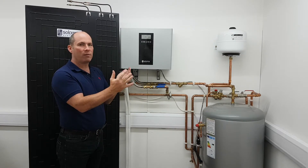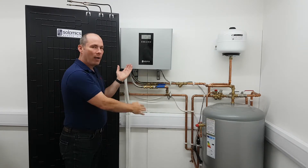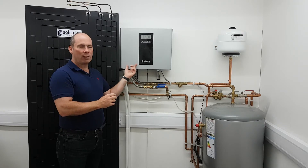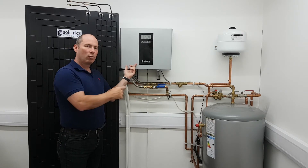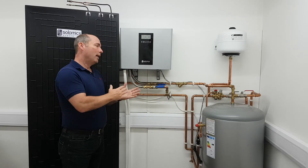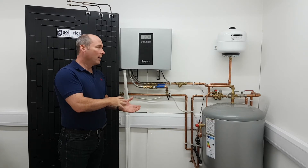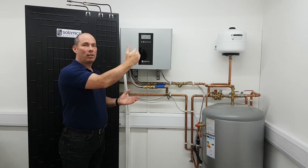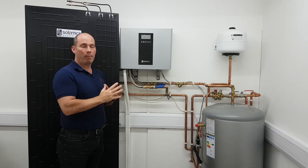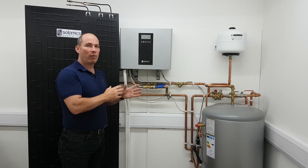So what are we going to do with that heat? Well it's very simple — we run the water past it, it picks all the heat up and away it goes. So the only cost for running this product is the cost of running a small water pump, which is just pumping that water around, and the cost of running a compressor. All that's going to happen is it's going to detect that your cylinder's temperature has dropped by more than 5 degrees, it's going to click on, work to bring it back to that target temperature, and then it's just going to switch off and be in standby. They're actually working less of the time than more — very quick recovery time.